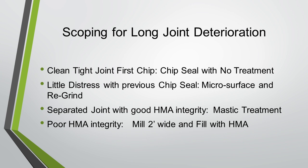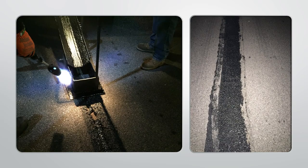The projects we're scoping now are for 2024, so we're about two years out scoping our preventive maintenance projects. A lot of times you'll see some distress and you have to predict what's going to happen over the next couple of years before the project is let. We're trying to get our offices to set up some quantity of repair based on what they think the distress might be. We've had some with pretty poor performance where we do have to go in and mill two feet and fill that with HMA. There's a photo of that joint separation in the lower left corner, showing using mastic to fill that joint.